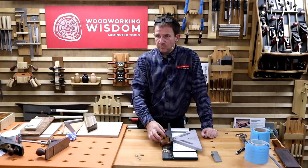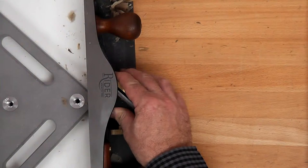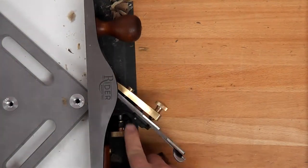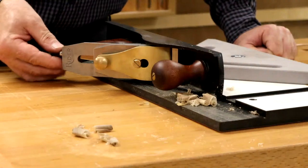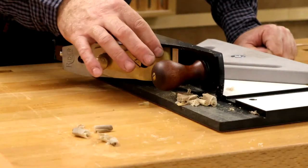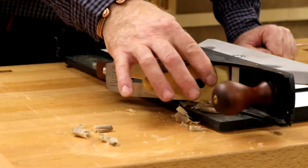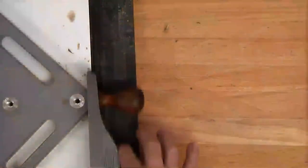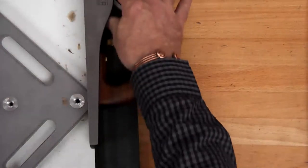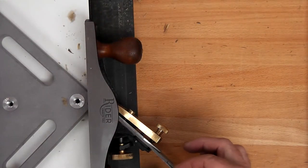Finger and thumb is beautiful to grip on a Bailey or Bedrock-style plane. Down in there, you grip around your blade, you're touching on the back of the frog onto the cap iron. You're keeping your fingers away from the lateral and your movements, so you're not adjusting things. If you've sharpened it, wax it, then you glide. Reduce friction helps you with that cut. You shouldn't be needing tons and tons of effort on this.